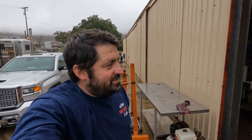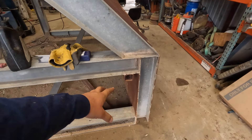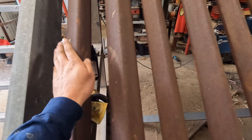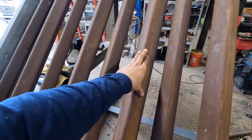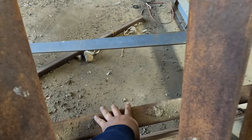I think we're going to make some pretty good progress on the dirt screen today — I'm home way sooner than I had initially planned because it started raining and everything got called off on the early side. Thinking about it over the night, I'm going to go ahead and build the hinge assembly. I've got to relocate some stuff — this bar right here being the main portion. I'm going to cut these welds off, take this whole assembly and move it up here, then build some fingers that are going to attach to basically every other bar. These bigger ones are going to be fixed in place — they're not going anywhere. I'm going to reinforce the welding on these so they take the brunt of what falls down. These are going to be what are called the cleaning bars.